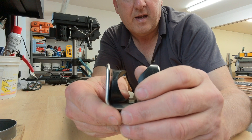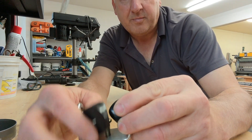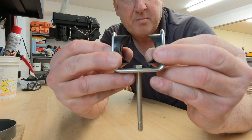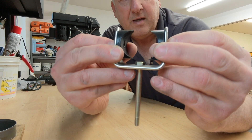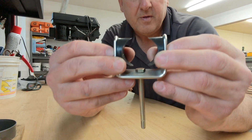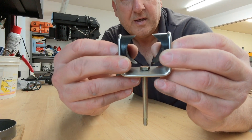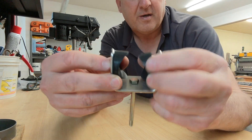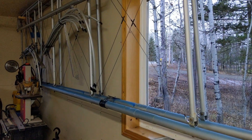If you are changing from the old bracket to the new bracket, you can see there's a difference in size, and the one thing not included in the kit is those little bushings. In order to get a nice fit, you have to order those bushings. Basically, the strut goes in between and gets secured the same as on the wing on top. Let me show you what I meant earlier about putting a strap around the whole thing and securing it to the longeron so there's really no chance of a failure.